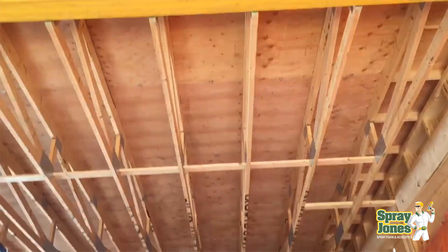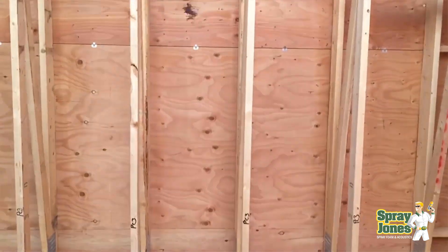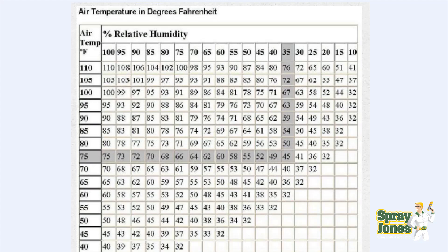Let's take a look at a very simple chart that will help us decipher this. Condensation occurs when you have three things: humidity level in the air, substrate temperature, and air temperature. Air temperature and humidity are relative to each other — hence relative humidity — because warmer or cooler air holds more or less water. At 75°F, you need the substrate to reach 45°F at 34% relative humidity to get condensation.